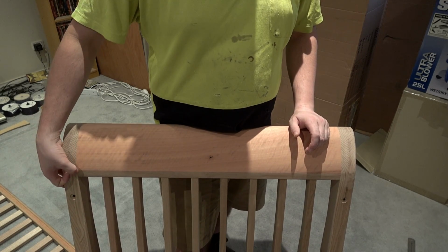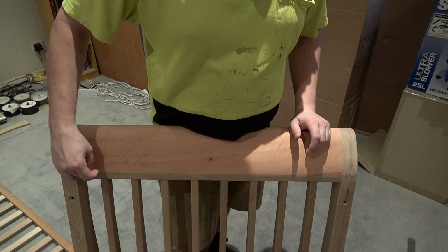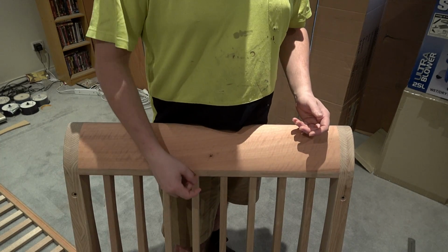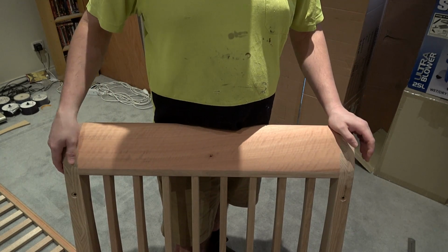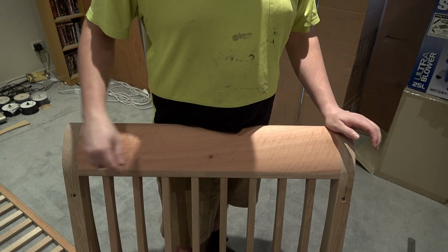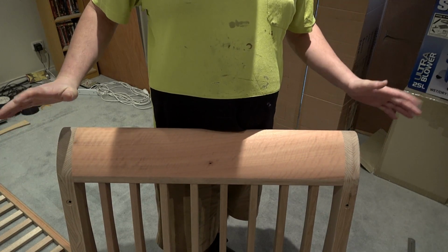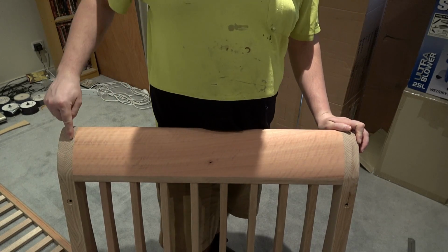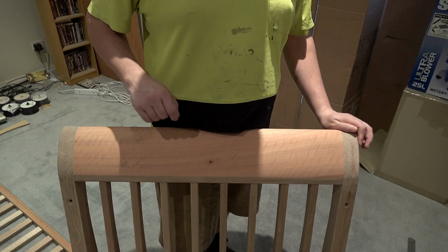So what I'm going to do is get a chisel and put a little V-groove in this edge here and along that joint there to give it a bit of a detail, because there are details. There's little quirks under here, and this being flush, it actually doesn't look quite right, and I haven't been overly happy with the way that it looks as is now. So I'll put this little detail in there with a V-groove and chisels, and it won't overcome the problem of the timber movement because this is an end grain to long grain connection, but it will disguise any defect that occurs from it.